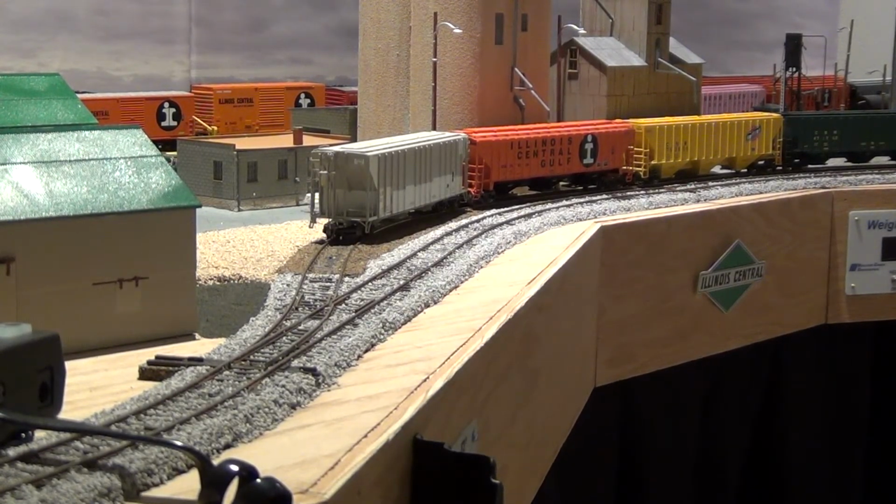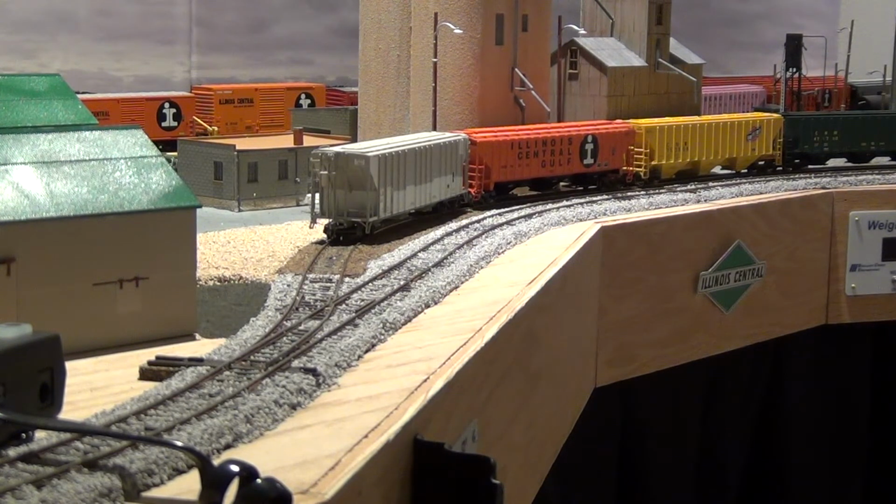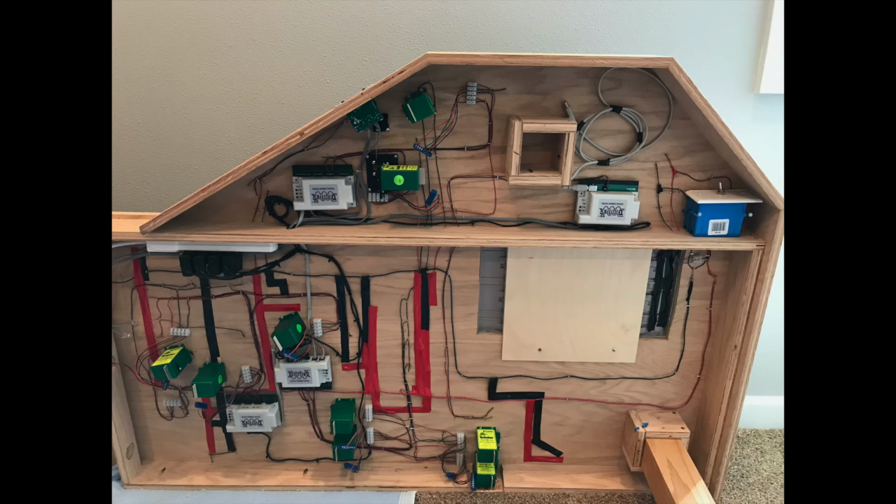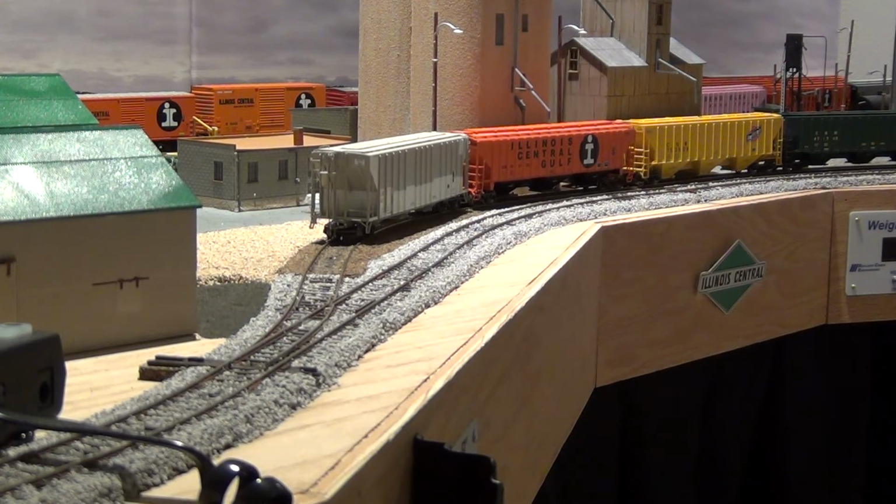So I'll talk just a little bit about the wiring of the layout here. I'm not going to crawl underneath there because I know I don't have enough light to be able to show you the wires. But I'm going to show you some still shots here. The nice thing about building a modular layout is that when I built it, I wired it while the layout was basically propped up on its side. So I ran plenty of feeder wires, and you can see those in the pictures I've taken. And, knock on wood, I have not had any electrical issues with this layout in terms of dead spots, shorts, anything. If you'll notice in these pictures, I have Tortoises wired up to all the turnouts. The Tortoises are wired up to DS64s, so I'm able to control the turnouts with my hand throttle, which is kind of nice.